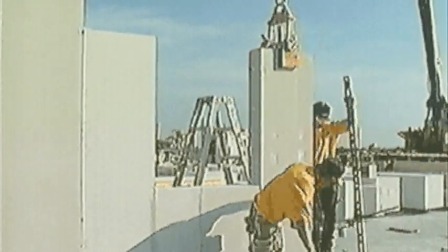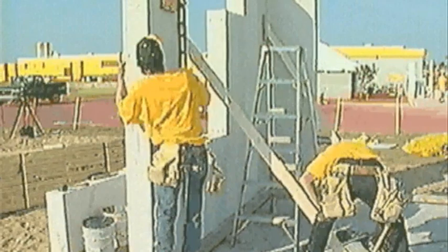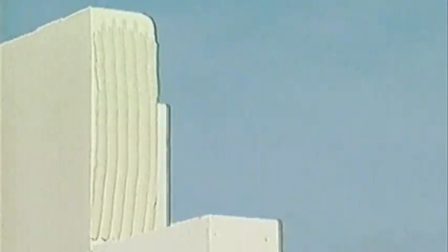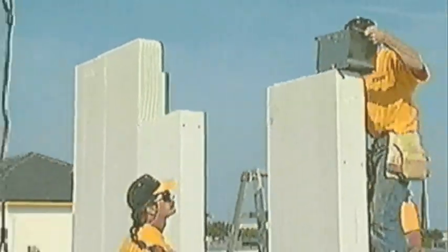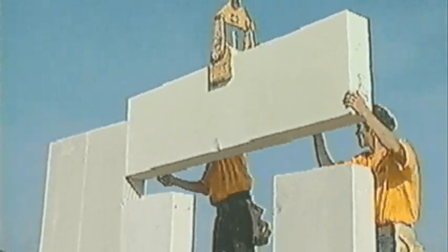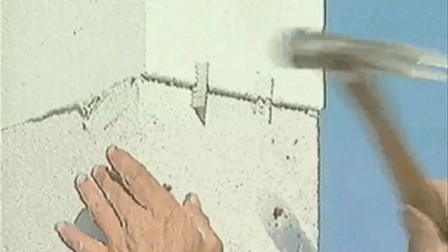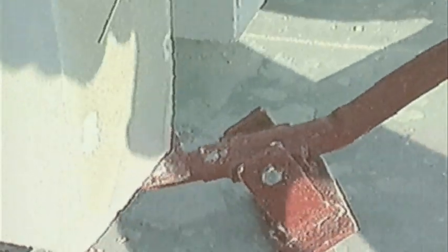Following the same procedure, the second jamb panel is installed and braced to the slab for additional stability and safety. The final piece, the lintel, is placed with mortar and secured with corrugated nails. The value panels shipped on pallets are easily separated by a pry bar to provide clearance when attaching the lifting clamp.